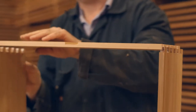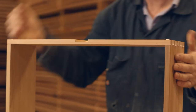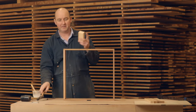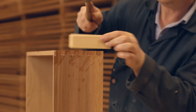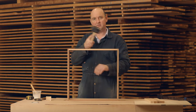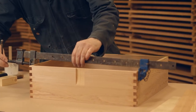Just offer the pieces in slightly to start with rather than trying to put the whole joint in at once, and then tap it down and in from each direction — a nice fit. Now we have to get all these joints nicely butted up together. If you only have a hammer and your block of wood, just tap them down and work your way around the roof. If you have a rubber mallet you can do the same with that, or you can use the sash cramp to pull the sides in.